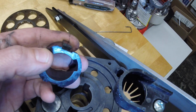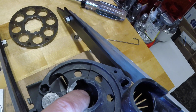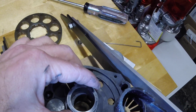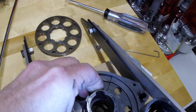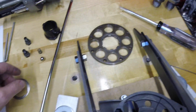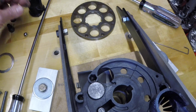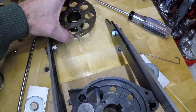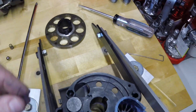This pin right here has everything lined up so that then that slanted groove, slanted keyway in the indexer would ride on the pin, and as it came up, it would give you your 1/8 of a turn index backwards. And then when the carrier went back up, it would turn this way until it lined up, and everything just drops through. So that's what's beneath the shell plate. Beneath the shell plate you have the index spring, or detent spring, the detent ball, and then the shell plate sets over the top of the indexer like this, and then the indexer cover goes over the top of it like that.